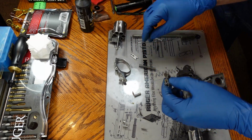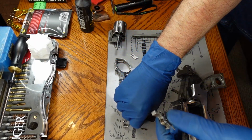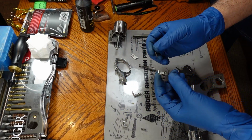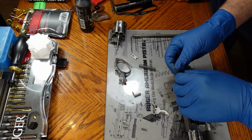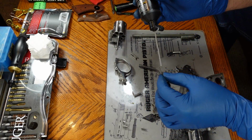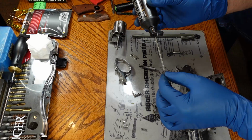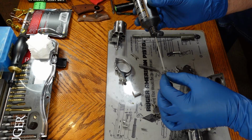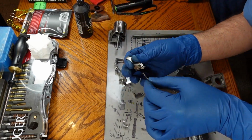No big deal. All right, so the big deal, okay, is the push paw, because the push paw has to have this little spring and plunger on it. So before we put it back in, we want to get some oil on it. Now be sparing, don't go crazy with it. Let her come out, okay, and just give it a little bit, okay, and a little bit on the pin itself because it slides into that socket.